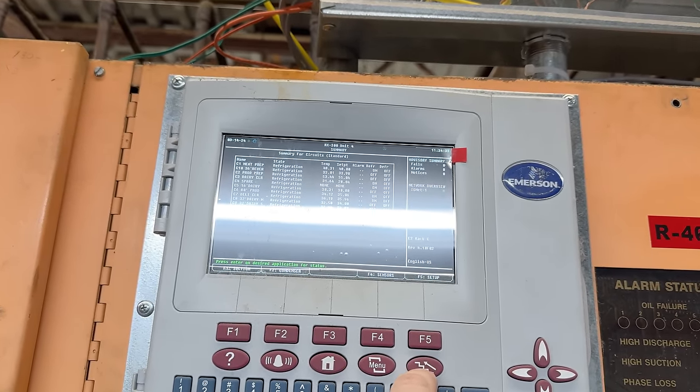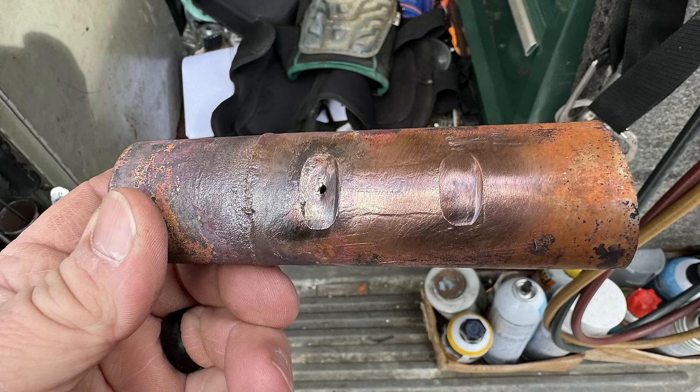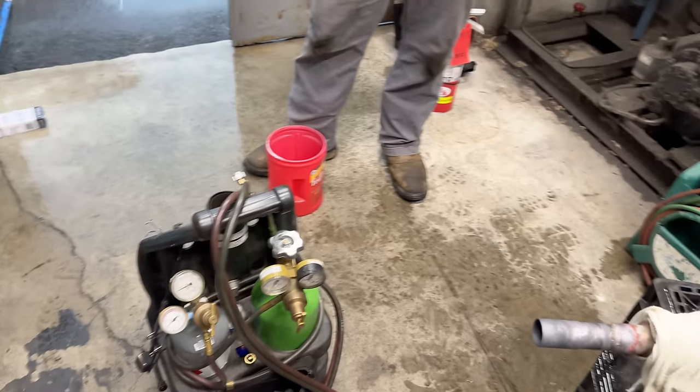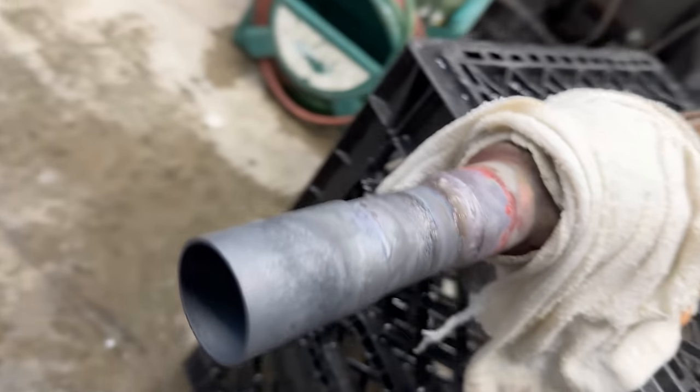I came back to the store and the coil had completely defrosted itself — took a couple of hours. I went up there to help another guy fix a leak on one of the racks. We got that fixed. Basically it was in a real bad spot — we ended up having to cut the piece out, unbolt it, chop out the bad section, unsweat the one pipe, put it back, get one side of the coupling done, and then sweat around it on the other coupling down in that corner. When I got back, everything was already thawed out and running fine. The noise was the liquid refrigerant going back into the compressor — that drip noise from the beginning. Right now, all we're doing is maintenances, so thanks for watching, guys. Until next time.